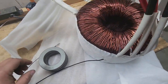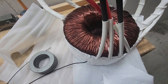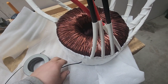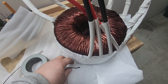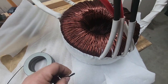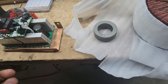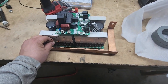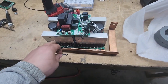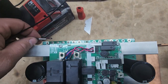And then you can see one of the reasons. Believe it or not, I didn't really think about it until I was doing my video yesterday when I was talking about the plastic and so on. I didn't even really think about the thermistors. So these are the thermistors that we actually use. We have two thermistors. This one here actually goes to the main board, and we have one on the AC side. This is your transformer input, and then we have one on the DC side.